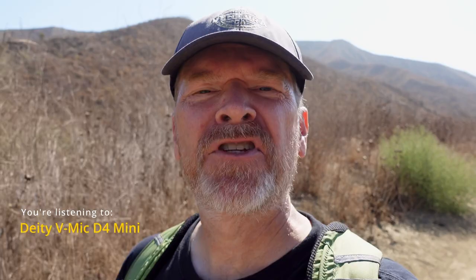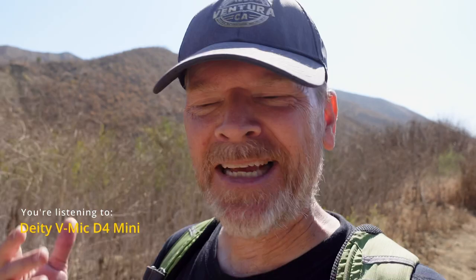The audio system on the ZV-1 is really thought out in general. You can use an external microphone — right now I'm using the Deity D4 V-Mic Mini, and it's just plug and play. If you have just bought a ZV-1, word of advice: the default volume level is set way too high on this camera, and you end up crashing against the built-in limiter and getting some really crunchy audio. I had to replace my ZV-1 — it stopped working under warranty, so Sony swapped it out. I forgot about that audio issue, so this is actually the second time I'm recording this segment because I ruined the first one.